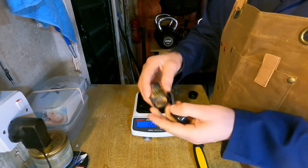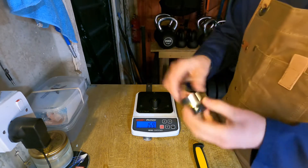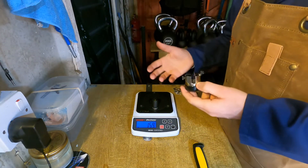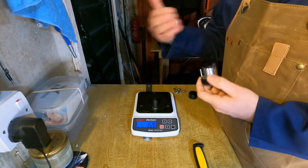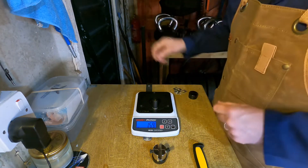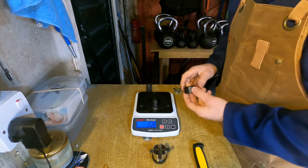The thread support comes with a spool underneath it — there's enough in there for about 350 to 400 tests depending on how much excess you leave off the end. This is the way I do most of my BESS measurements when I'm just doing checks during a sharpening or when I've got a new knife and just want to see roughly where it lands. But for any sort of official results, because of this tension issue, Edge On Up — the maker of this system — has another solution.